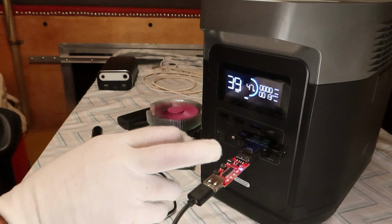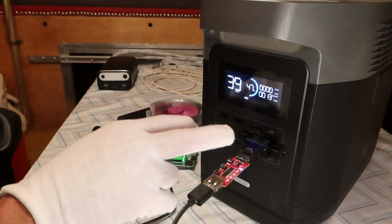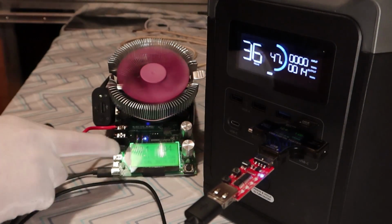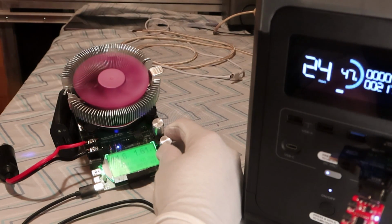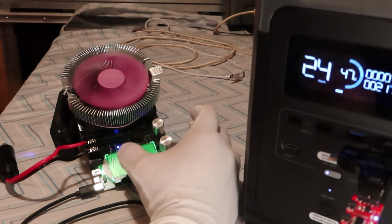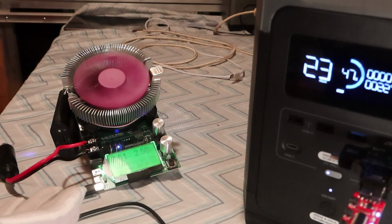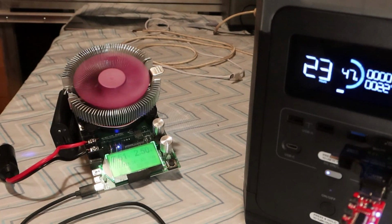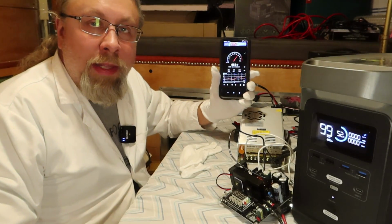So we're going to check using this little utility, which allows me to manually tell it which voltage to output for the quick charge port. So we have it hardwired right now at 12.4 volts. We'll do a little bit of a zoom. I'm going to go ahead and turn up the amps, watch the watts here, and watch what happens to the voltage when we turn it up past its limit. Okay, we're at 1.5 amps. Still able to pull the 12 volts, 18 watts. So at 2 amps, the 12 volts has dropped all the way to 9.5 volts. Over here it says 10 volts. There we are at 2.5 amps, and that's supposed to be 12 volts, but it's only 7.5 volts. Again, 18 watts, and over here, 22. So it looks like the actual limit on the USB-A quick charge ports is 22 watts, regardless of the voltage setting.